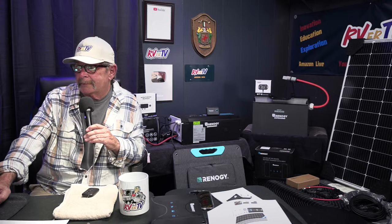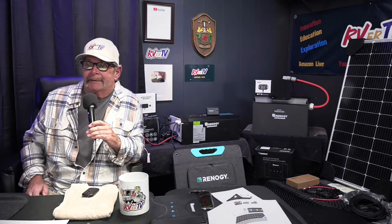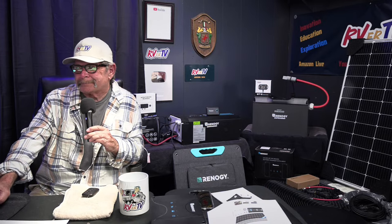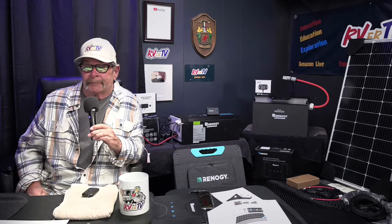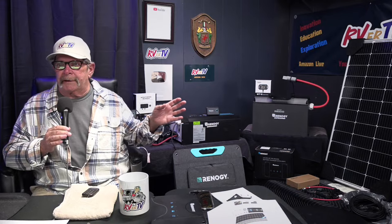John G says he only uses Renogy for all his power banks — you always know they are quality. Big Drink Tea's setup is also four years old. His batteries are on their 228th charge cycle. Most of these batteries are rated for 3,000 to 5,000 charge cycles — that's a 10-year battery at least, if you're pounding on it every day. Kevin has 100 watts for his truck camper batteries and 200 watts for his Delta II. You match your power to your needs and battery size. With a small truck camper you can run a fan, small fridge, or 12 volt fridge. You can run not only 110 but also 12 volt off this stuff. A lot of systems now go 24 volt and 48 volt — that's where you get into the larger off-grid system.